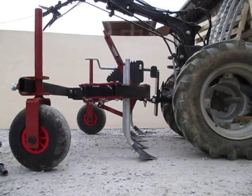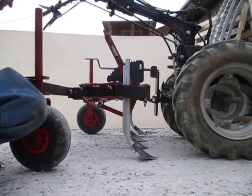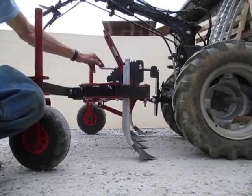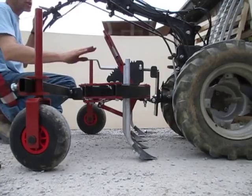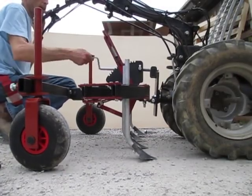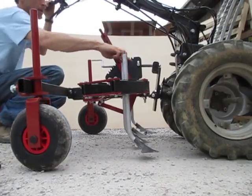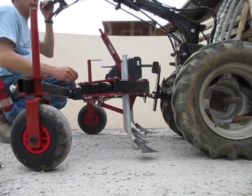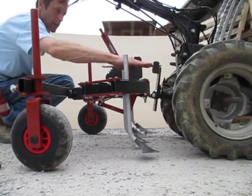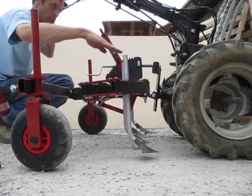We're going to talk a little more about the adjustable frame cultivator from Earth Tools. This is an implement made for our BCS and Grillo walk-behind tractors. The first thing to understand is the angle adjustment crank. When you crank this thing up and down, it's changing the angle at which the cultivator interfaces with the tractor. It's basically bending the thing in the middle right at the pivot point, changing the angle of those cultivator sweeps at the bottom — cranking them back. So you can change the angle of aggressivity, how much those things are ramping down into the soil.